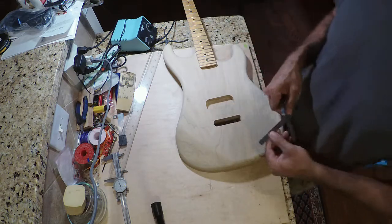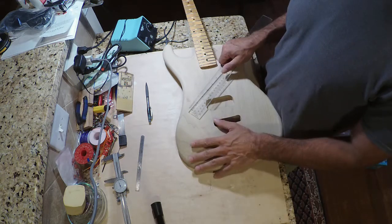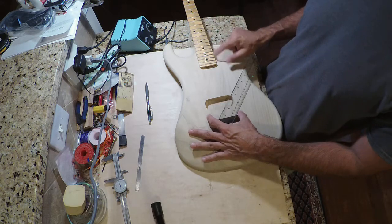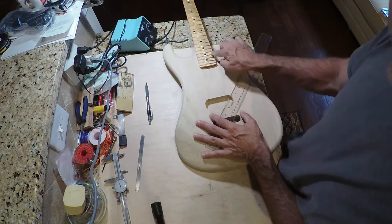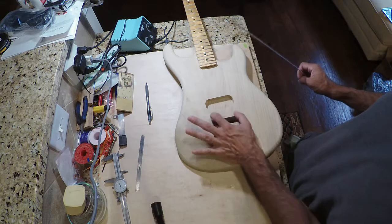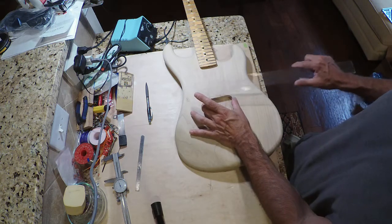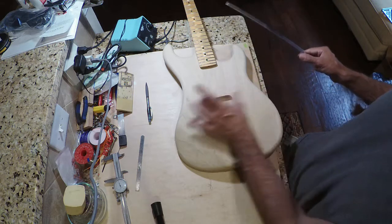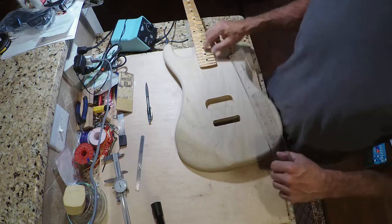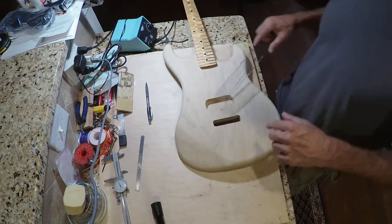Now we can see how that center line relates to the humbucker cavity. I don't think Kramer actually checked for this, because some of the guitars I've got have the strings hanging off the fretboard a little - they always seem to be biased toward the treble side. You can fall off the edge on one side but there's plenty of room on the other. It always seems to be a problem with many guitars. But if you do this when you're going to locate your bridge and make sure the humbucker sits in between the two E strings without being biased too much to either side, the humbucker will sound better. Also, the guitar will play much better if the strings are on the fretboard and not falling off the edge. When you're using a very thin neck, it's even more important to get this right because there really isn't much room for error.